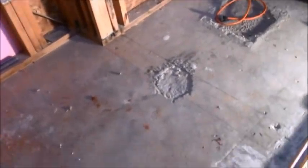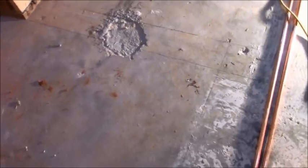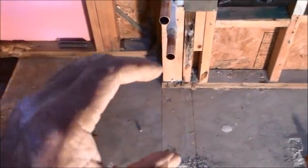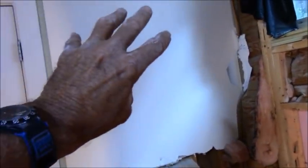And now we get over to this wall that used to actually be a wall, but it's not anymore because that was part of the shower, right? And so now it's not part of the shower, and so there's going to be a 2x6 wall because this big giant pipe I have to make into eventually half inch and go up to a shower valve. Then that will be half inch and half inch and go up to a shower valve. So there's going to be a shower fixture here with a handheld wand on a sliding bar, and there's going to be a replication of that on this wall when it gets built. It's going to come out about 3 foot and stop right there, and go all the way to the ceiling. So it's going to be one solid wall that's going to replicate everything on this side, yeah, his and hers.